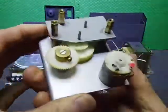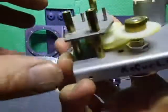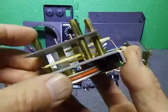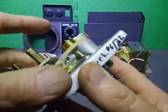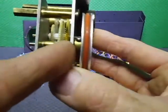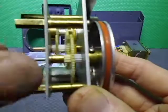I've stripped the whole thing down. There's discoloration on the gears — someone oiled the tips of the gears and the shafts, and it ran down everywhere, even onto the potentiometer shaft. When I pulled the gear off I couldn't turn the pot — it was frozen solid. I had to replace the primary gear in here, which you can see is a different color, as it was spinning on the shaft.